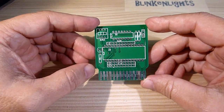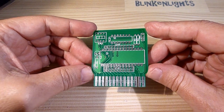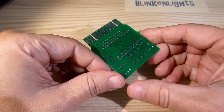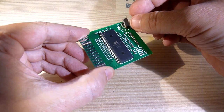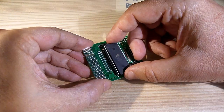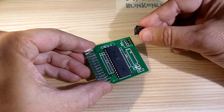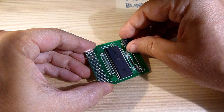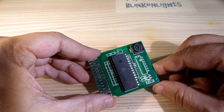The PCB accepts 64K and 256K EEPROM chips, because they have the same pinout. So you can store either two banks of voices if you mount the 64K chip and the switch, or 8 of them if you mount a 256K chip and an 8 position encoding switch. Well, you could if I had designed the PCB correctly, but I didn't, so we'll do another 2-bank cartridge.